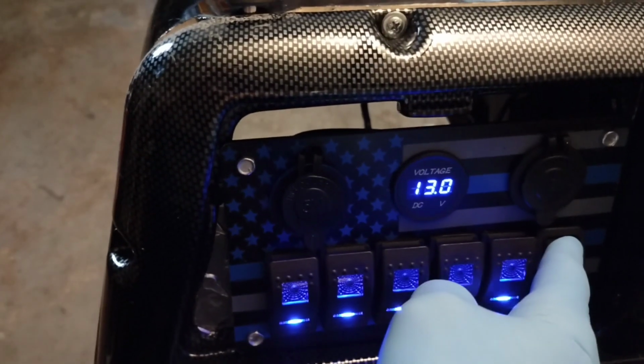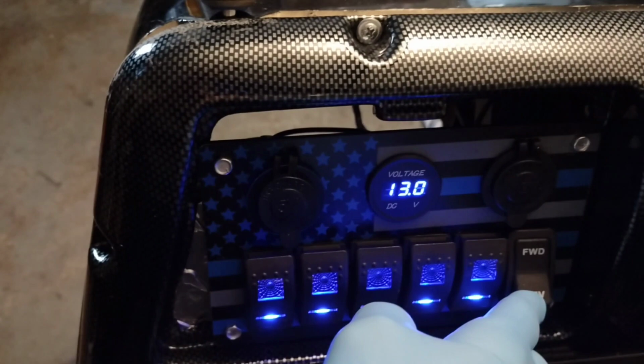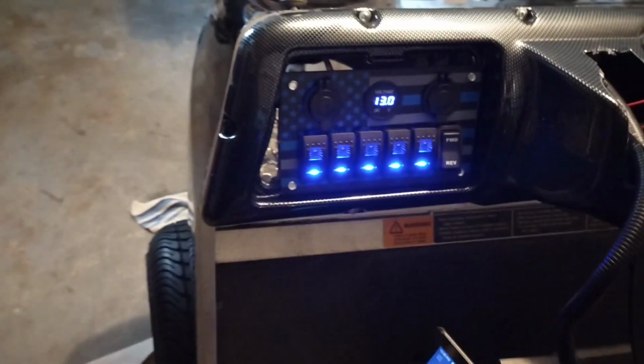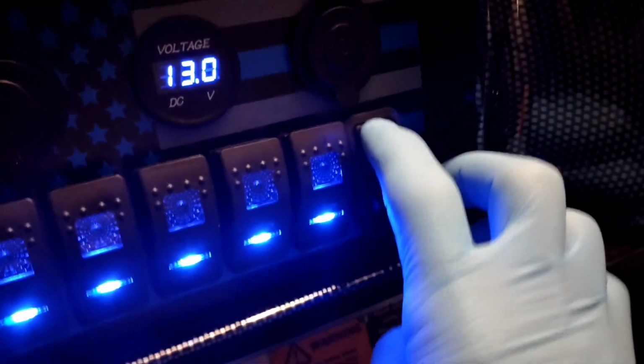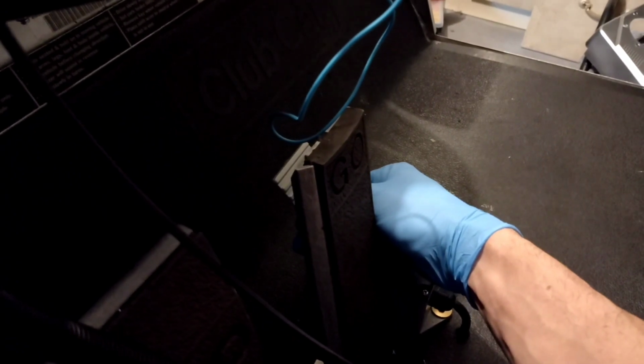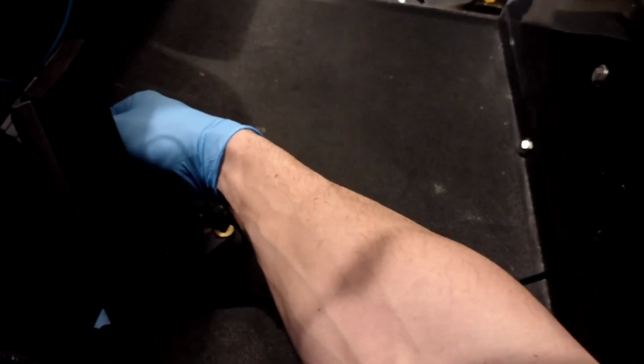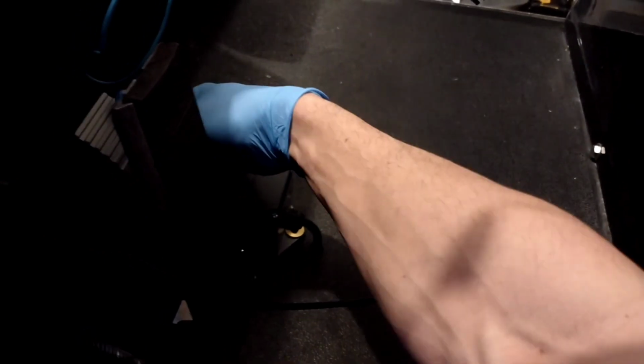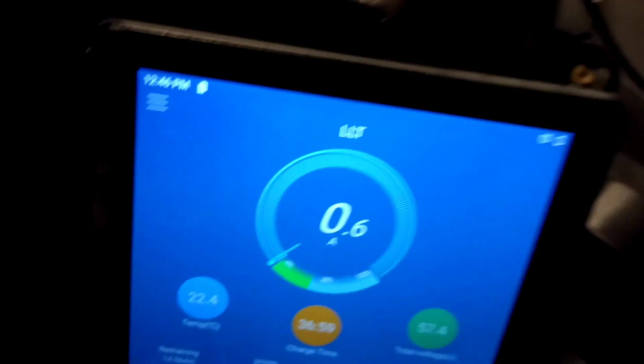Let's try out the forward and reverse. Ooh, look at that, eh? Click, click. Clickety click. Alright, so that's working pretty good. I guess the next step is to push the pedal. I need somebody to hold the camera for me. Alright, so let's turn the forward back on again. Now when I push this pedal, you can actually hear another click, which is the main solenoid. Bing. And now we should get some tire spin. Alright, nothing yet. Anything on the amps when I do that? Nothing, so...